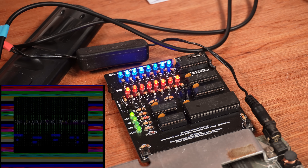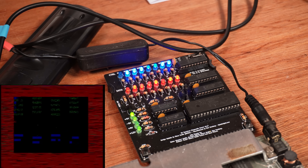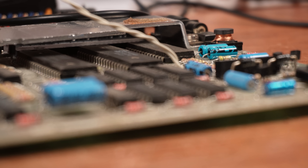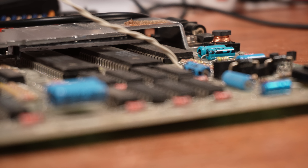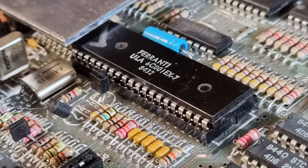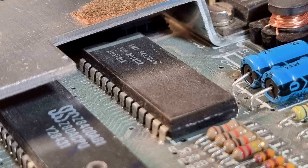The next thing is the result of the diagnostics, which is saying all of the lower RAM is faulty. There are a few things to consider here. The chances of all the lower RAM going faulty at the same time are small - certainly not impossible, I've seen it myself - but it's less likely than some of the other options. There's a chance that the capacitors have degraded to the point they're causing this whole problem by themselves, but the flip side is this is a later revision board and the caps are usually okay. All of the memory being reported faulty at the same time could also point to a bad ZX8401. The ULA is a dash-7 version and those are usually very reliable. The CPU is good as it's running code. The ROM could possibly be faulty.